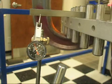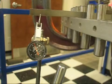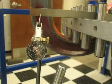The motor is now commanded to move away from the 0 position and then return to the new 0 position. As you can see, on successive moves, the motor returns to 0 with a variance less than 1/10,000th of an inch. Keep in mind that this is on a 27-inch radius from center.